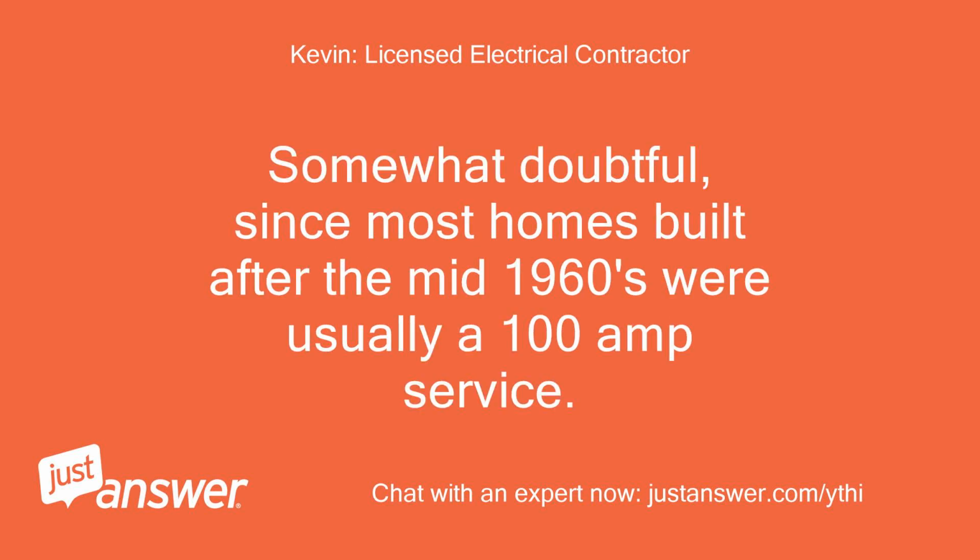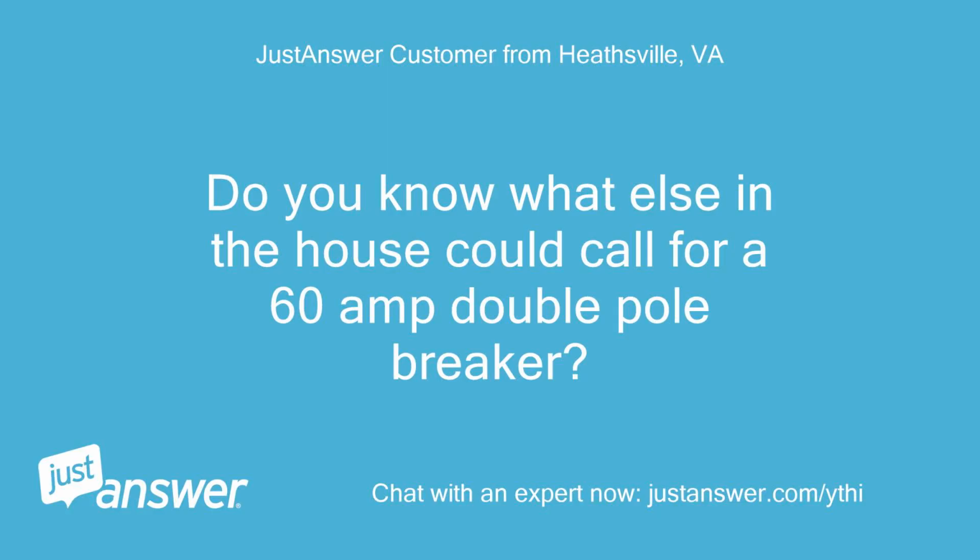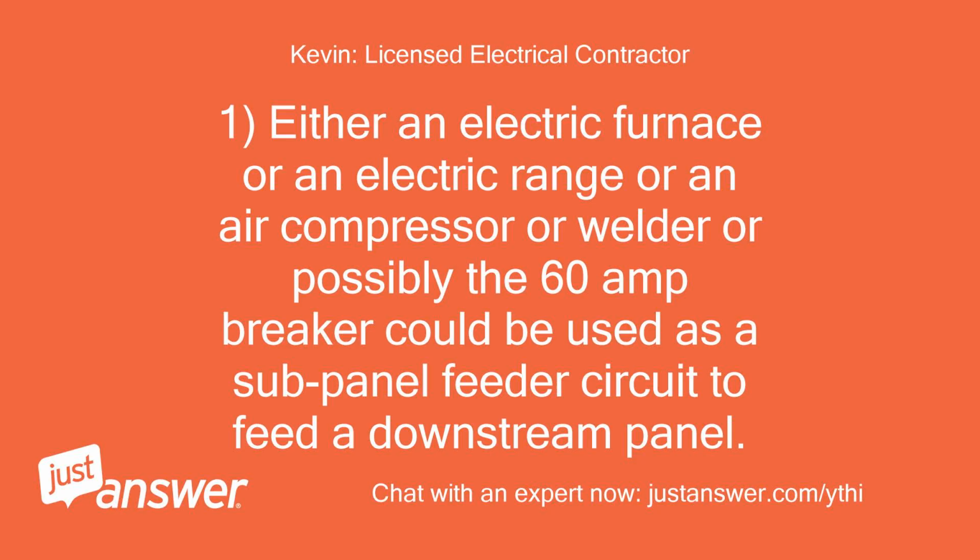Somewhat doubtful, since most homes built after the mid-1960s were usually a 100 amp service. But anything is possible. Do you know what else in the house could call for a 60 amp double pole breaker? Either an electric furnace or an electric range or an air compressor or welder, or possibly the 60 amp breaker could be used as a sub-panel feeder circuit to feed a downstream panel.